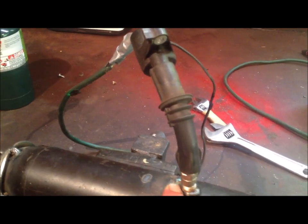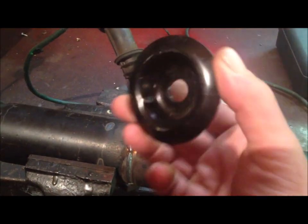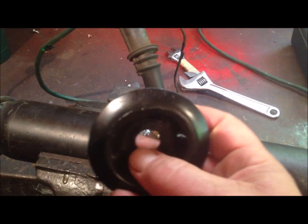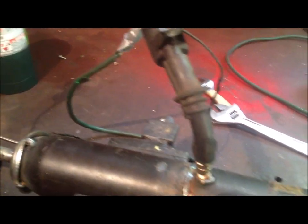Placement of the spark plug is actually critical — it has to be slightly above the halfway mark. I also built a diffuser, which is made out of basically a frame washer for a '99 Buick LeSabre. I drilled a couple more holes in it, but anyway, that's to prevent some of the pulse from going back into the mixing chamber.